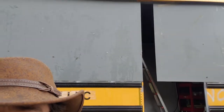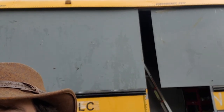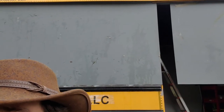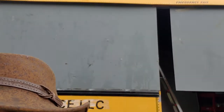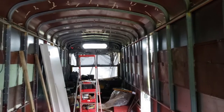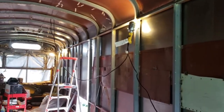I do have to make the cut line on that overhanging piece in the doorway. I'm going to leave some at the top at the height — I'd already marked the door frame height on the inside. That'll be some metal to help back the sheet metal covering that little gap. That sheet will go in behind the frontward sheet. It's actually pretty dark in here — I'm going to reconnect my trouble lights so I have some light to work inside. And then there was light. Pretty dark in here till we get some RV windows installed later in the process.